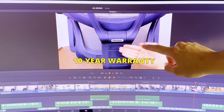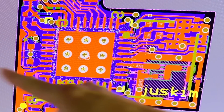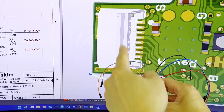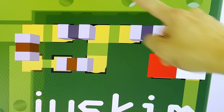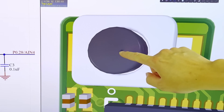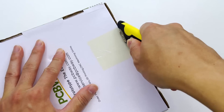While I was talking about the C7 chair, I finished up the circuit board schematic and layout, which contains all the parts we've previously talked about. This includes the battery charger, the RGB LED lighting, ribbon cable connector for programming and debugging, and most importantly, the Bluetooth ARM microcontroller with a 2.4 gigahertz antenna circuit. This tiny thing is actually an antenna for Bluetooth communication. For testing and changing the keyboard behavior, I added an extra button. And with video magic, the manufactured circuit boards arrived in seconds.